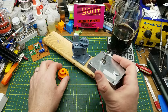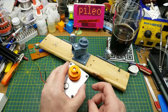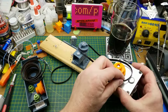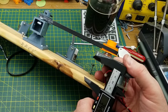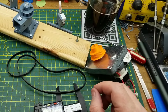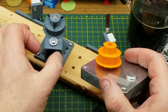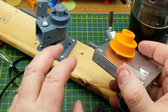To mount this up I need to measure where it fits, so I had to print a pulley to fit on the shaft using the same timing belts as before. That belt's too short — let's try the next one — that goes way over there. The height looks like about 35 millimeters. I'll make up some sort of bracket and while I'm in CAD I'm going to replace the existing pulley with a bigger gear to get a better reduction ratio — I still want some more reduction even though this motor is relatively slow.